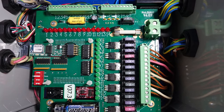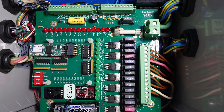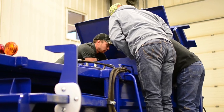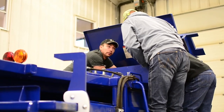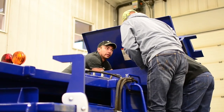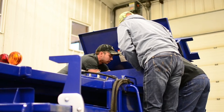This board is held on by four screws. Whenever I say swap boards or pull the board out, it's literally these four screws. You loosen up the screws on each side of these plugs - you've got three plugs - and then power and ground coming in. Pull the power and ground, pull these three plugs, and that whole unit comes out. You can literally switch a board out in a matter of five minutes. This is the only thing you'll actually have to unwire - the power and ground - because there's more voltage going through that and we wanted a good solid connection.